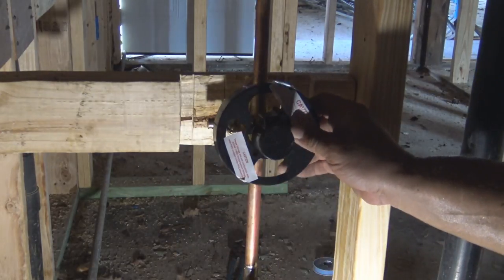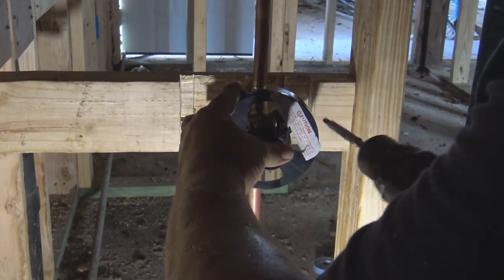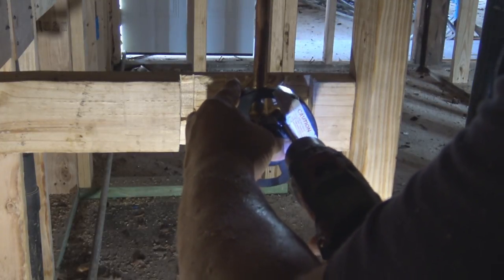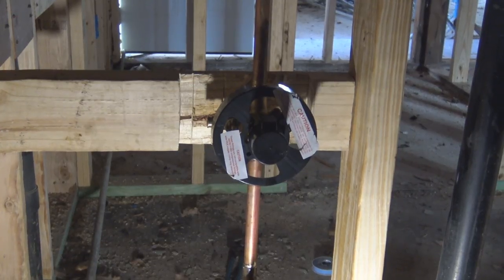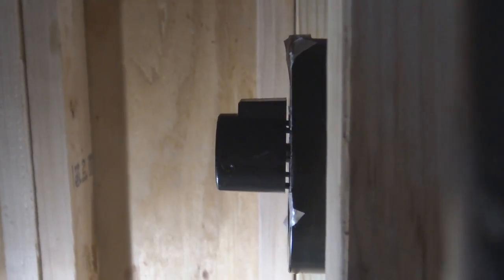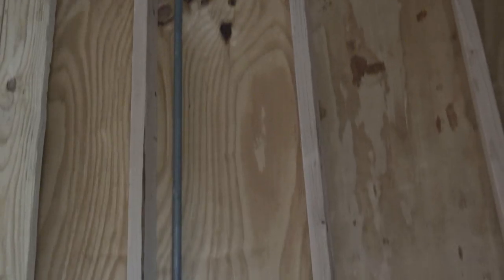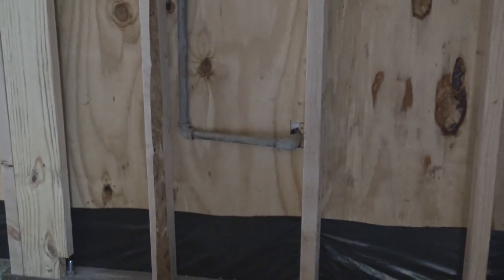And again, we want to keep this on. This is the guide for the drywallers and the tilers to know where they're at and things are done properly. And another thing that I see that's really kind of frustrating is that once these are in place, I've gone to homes where whoever installed the tub and shower valve, you can see right there, they see that angle. If you have half inch drywall, then the tile, it comes out just right. But anyway, they leave that shield and that bracing on there. So when you go to pull it off, you have to fight to get the thing off of there so that you can get access to the tub and shower valve.